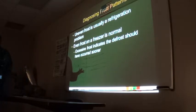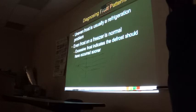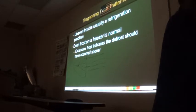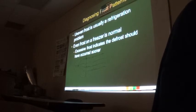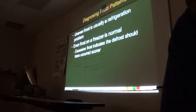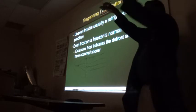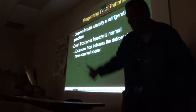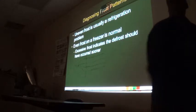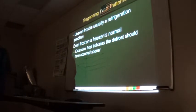We spoke about rack systems, right? I did tell you some of these things are up on the roof. Imagine I have this rack system up here, and down here is the service area, and I have a unit right in the middle of my service area. The line that supplies this unit has to come down from the roof, through all the ceiling, through the walls. Chances are it's going to come onto the floor and then come up to that. If this has a leak someplace, how am I going to find that? Break the wall down. No way I'm breaking that wall.